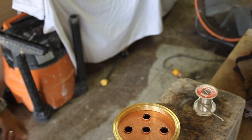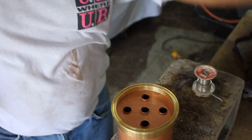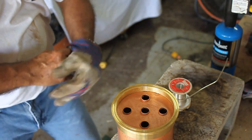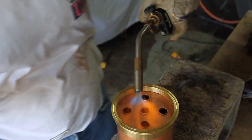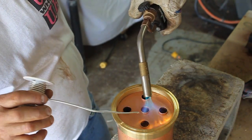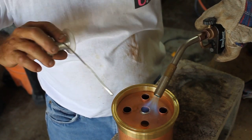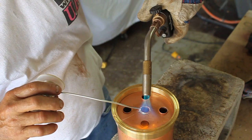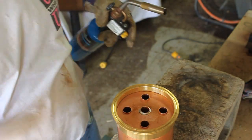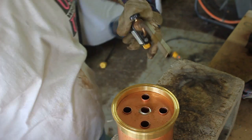You should be able to see that pretty good. I'm gonna drop that down just a little bit more so you can see it. I'll show you how I take care of that — get enough material out on that, start in the center and work my way out. Don't be afraid to add some more flux as you go along; you cannot put too much of this material on here. It's going to help with the wicking.